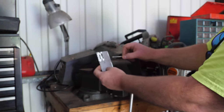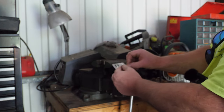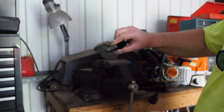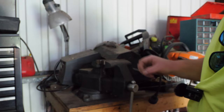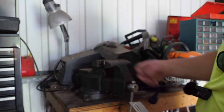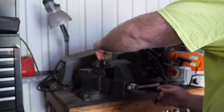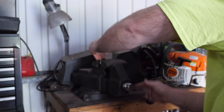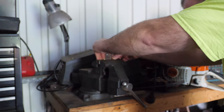My game plan is, I want to get the bend started, and to account for the thickness of this little lever, this little clamp, I guesstimated, and I overshot it intentionally. I'm going to use a drill bit. That's how I'm going to create that radius. And I'll give you the numbers when I get back home. I don't have enough light here to see with. But anyway, I'm going to start the bend, and then we'll finish it off, hopefully quickly. Quick and dirty, quick and easy, something like that.